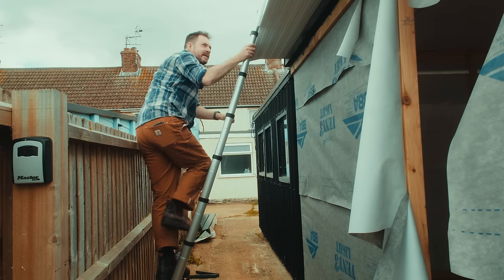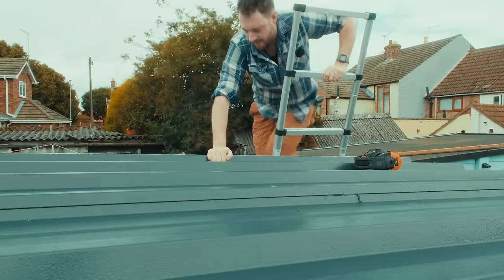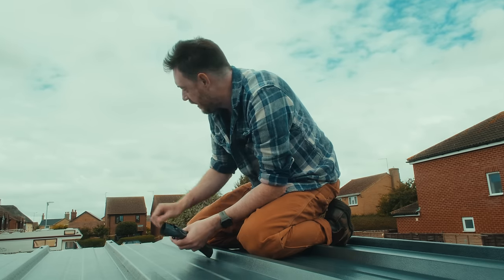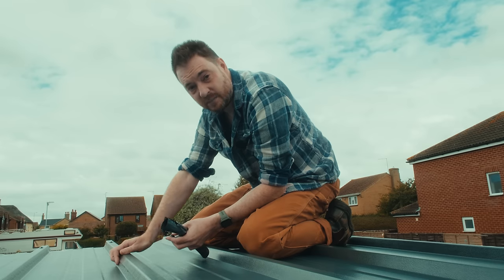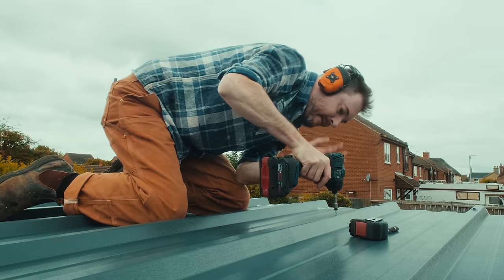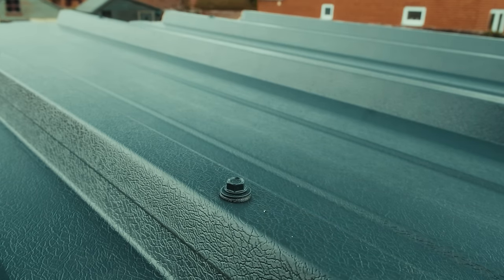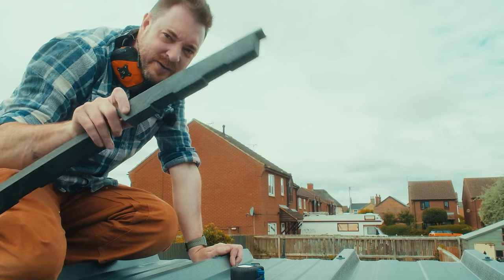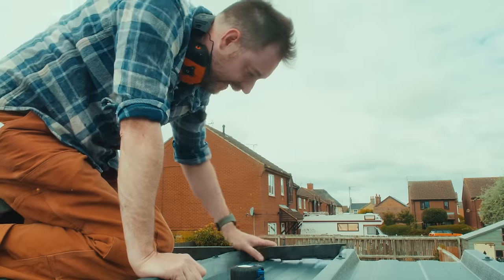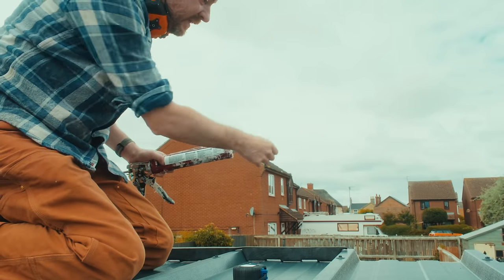I'm rested, so now I need to continue but I've got to go on the roof for it. What I need to do now is get some more screws in — this time some little short ones where the two sheets have overlapped — and just get them locked together down the whole run with a 45 centimetre spacing on the screws. Right, that's all stitched together. Now I'm going to install these foam bits along the front to stop animals getting under it. They go on with some adhesive, so I'm going to run a bead along and then get these stuck down in place.